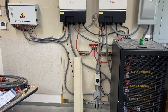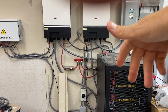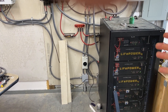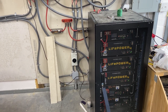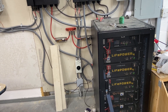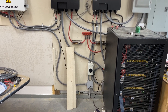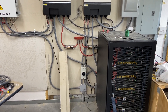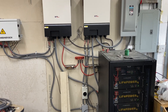I just wanted to test and see what it could do. So to recap: these units can each do 120 amps output of charge at 48 volts, and these batteries ideally want 20 amps charge and 30 amps discharge at an ideal setting. Multiply those by 48 volts to figure out your system wattage. It's obviously going to be a budget thing for people too, but this is something I didn't fully consider when sizing my bank. Thanks for watching — leave a comment if you have questions on the numbers or if I got something wrong.